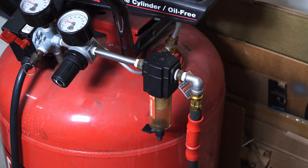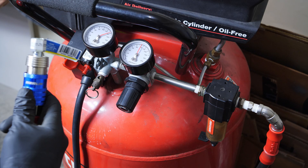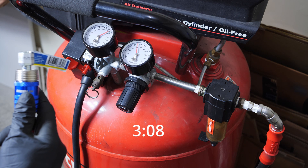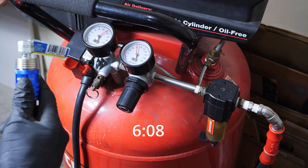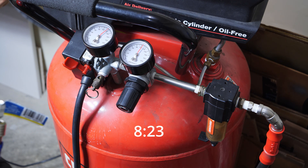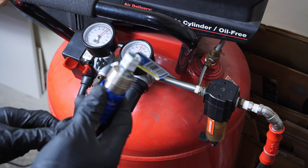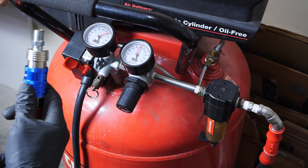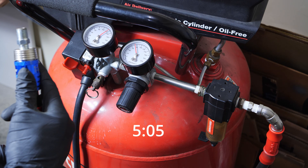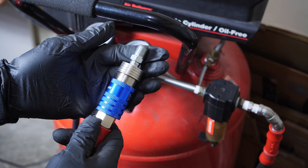You can see that's the 90-degree on the air compressor right there — it's such a harsh bend that it's restricting airflow, whereas the 45 gives you a nicer smoother radius. Now starting the test again — look, there's just so much more airflow. This is the control, the stock unmodified air fitting, and it comes in at eight seconds. Remember the first test was 11 seconds, so just removing couplers got us down to eight on the stock fitting.